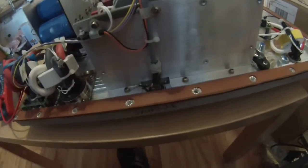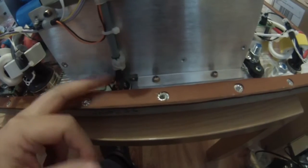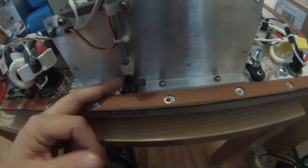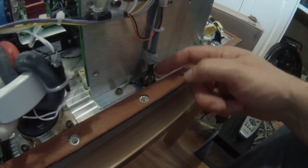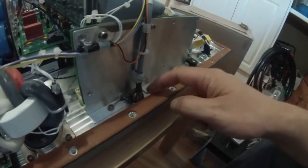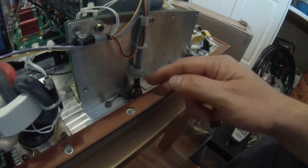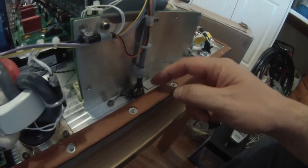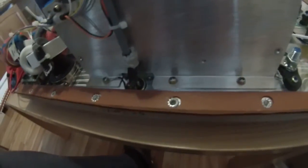This is our ANOVA inverter, and what we're looking at specifically is the connector for the encoder. The first thing we notice is that of the seven pins on the plug, only six of them are in use. That makes perfect sense — we need a power and a ground for the encoder, an A and a B signal channel, then two wires for a motor temperature sensor, giving us a total of six wires.